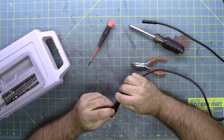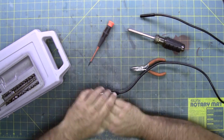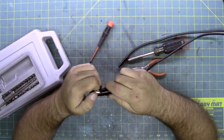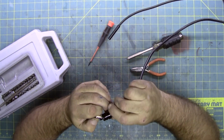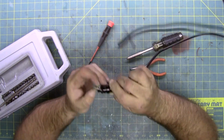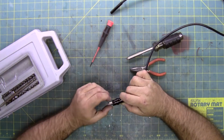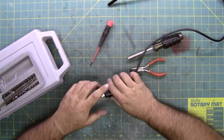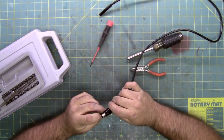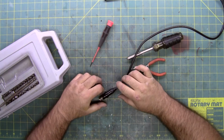Just examining the wire to make sure that even though the pin's broke, the wire is still soldered on the back side. So you can carefully pry this bad boy out, and the pin that's broke has a green wire attached to it on the back side. It's going to be really hard to see. We're talking really fine stuff. So now we need to replace a pin. That's going to be a trick on its own.